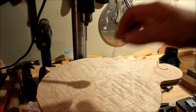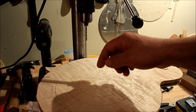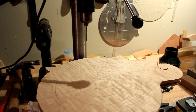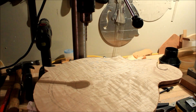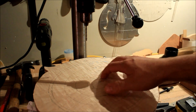For the past few mandolins I've been using 431 while tuning my components, and I want to try it on this mandola as well. So what I'll do here on the drill press is use a drill bit to create the depth I need to remove wood, going down towards the ends, and then I'll use a gouge to remove the wood, and scrapers and sandpaper to carve the scroll. I'll do this step quite quickly and then come back for the tuning of the board.